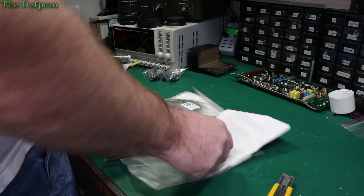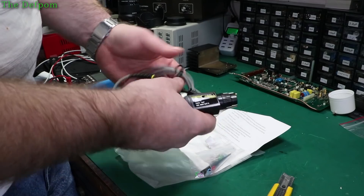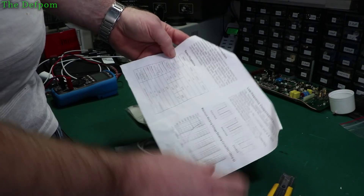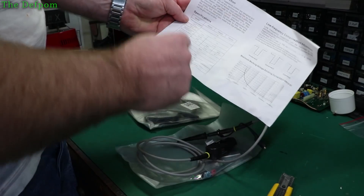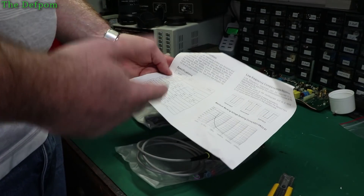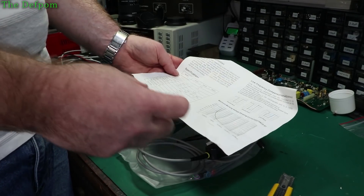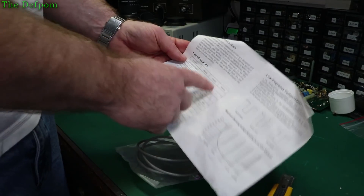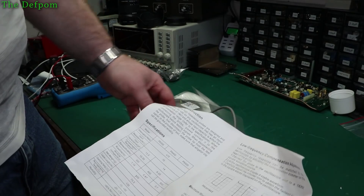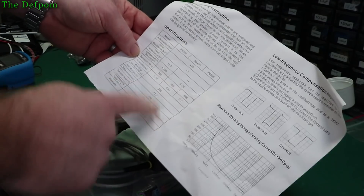So I thought I better get some. They're 500 megahertz apparently, but they're fairly cheap, so we'll see what we get. There's a times 10 fixed ratio. When you go to times one, your bandwidth actually drops down to something like 6 megahertz typically — it's really narrow bandwidth at times one. So times 10 fixed value, it's not that bad. If I need a lower sensitivity, then I'll just have to change probes.